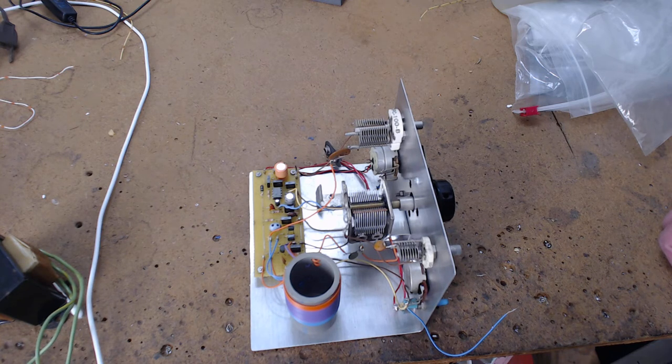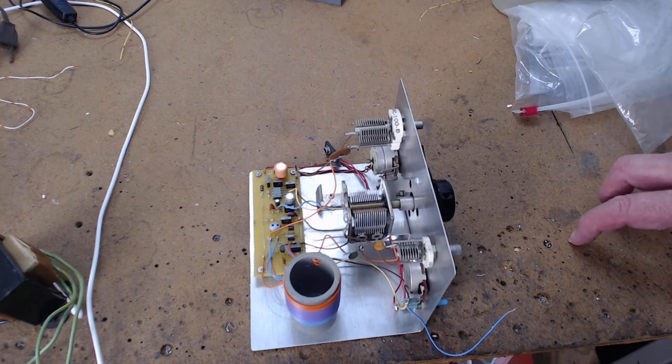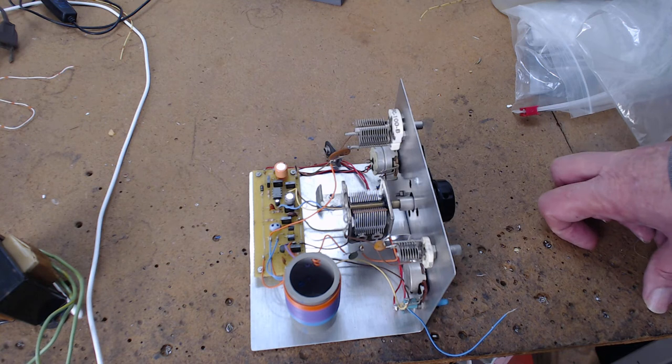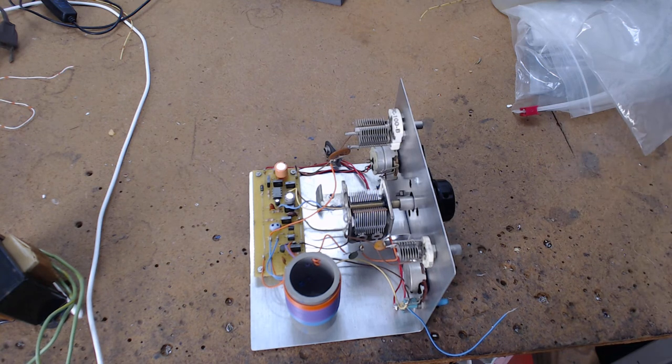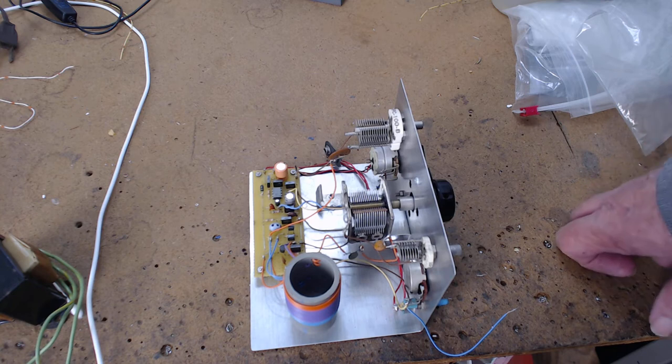And the same if you build a tube circuit. You put in 8-ohm headphones, it's not going to work. You might get an indication of something overheating with the tube set because the voltage is higher. But I can guarantee you right now, there are finished regenerative sets sitting that don't work because the person used the wrong headphones. And there are headphones that you can still buy surplus. They're called 2,000 ohm headphones, and they look identical to a little earbud thing, but there are more windings in there. Higher impedance changes the bias of the transistors so they will work.